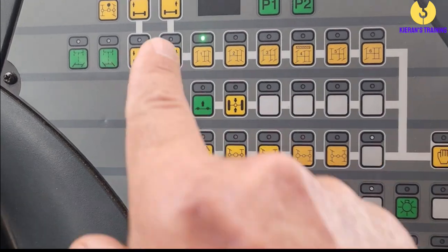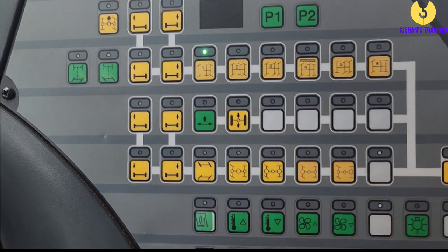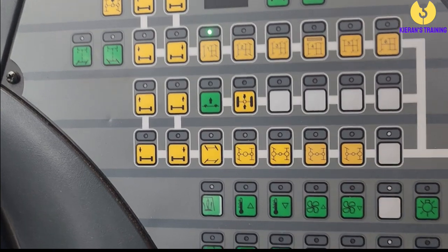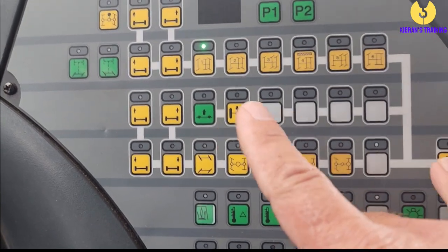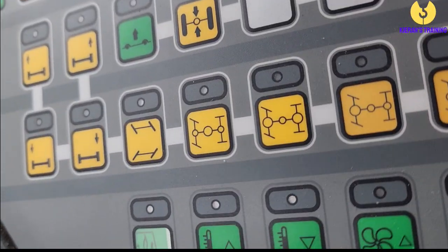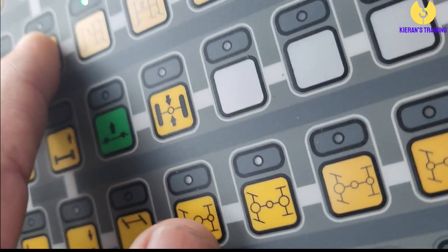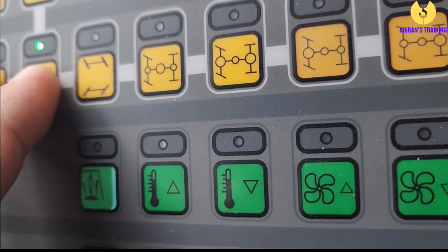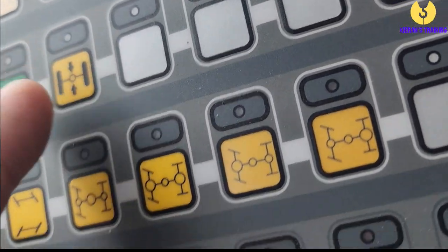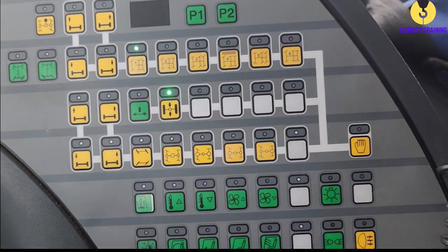Keep in mind the suspension lock — if you're traveling on the road, that's got to be turned off. From there you'd put it into Drive and travel away. When you rock up to site the first thing you need to do is drop your suspension and then lock your axles out. So with one finger on the hand button, I can come down on the front suspension and then down on the rear. Once they're both down, hit that suspension lock button and now it's all ready to get set up underneath.